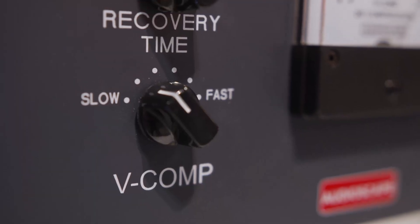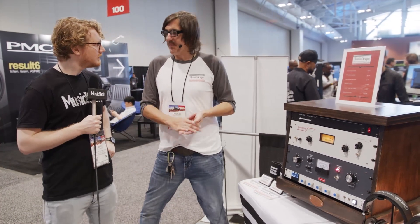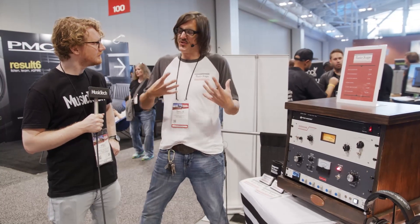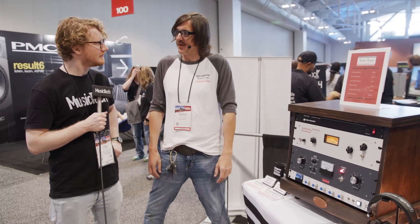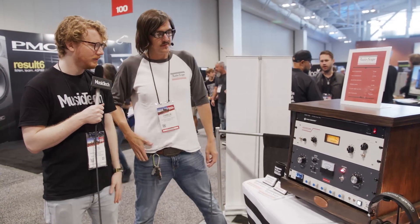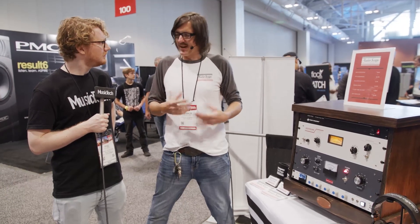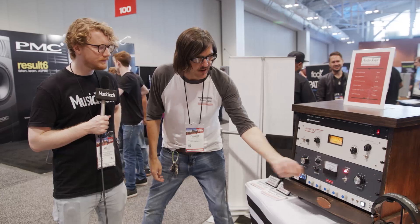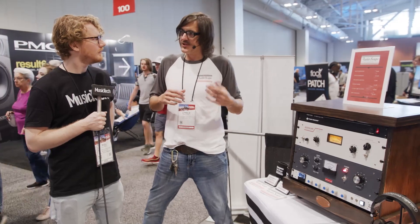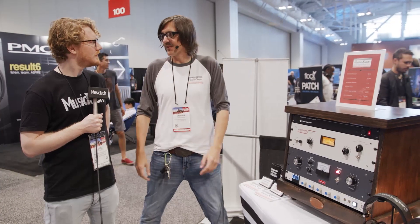But this is the big one here. And what are the applications for this? Awesome on vocals, awesome on bass. I call it like the Johnny Cash compressor — it's just got that thick, dark, massive sound to it. Very, very cool. There are seven tubes in this thing. And what difference does turning the recovery time knob make? Fast will get you more of that breathy, pumpy, Beatles sort of drum sound — more of a 50s, 60s thing. But as you go slower, you're able to do 30, 40 dB of compression and not even hear it, except for that slight coloration. So you can really just peg that meter on a vocal and it just sits right in your mix, perfectly.